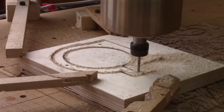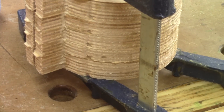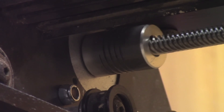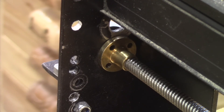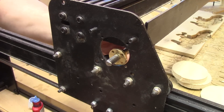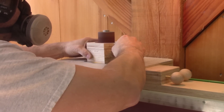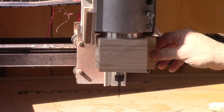I'm not totally done, because I'd like to build a new support for my laser. After cutting four layers of plywood, I glue them together. But I noticed that even if this will work, the rounds are not perfectly round — and it's only now that I noticed that. This type of motor coupler was not a good idea. Because of this, the X-axis is all messed up. I don't have any problem with the Y-axis because I glued the nut at the other end of the threaded rod. Now I'll do the same thing on the X-axis. I bought new couplers that I'll eventually receive, but for now this fix has to do the trick. After sanding the inside of my new laser support, I can try it — it's perfect, so I can screw the actual laser support in front of the new one.